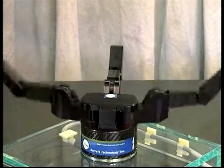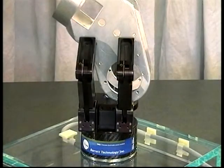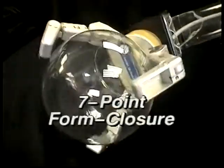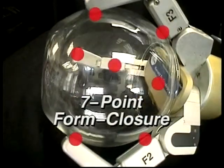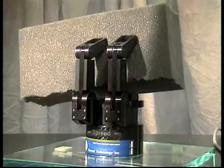During each grasp, the Barrett hand automatically seeks to find the most stable position, even if the object's exact shape is not well known. The result is a secure seven-point form closure grasp, adaptable to uncertainties in size, shape, orientation, and texture.